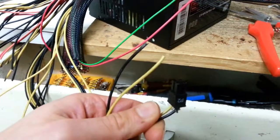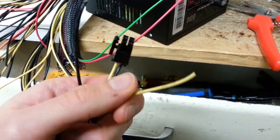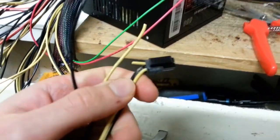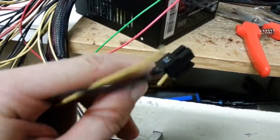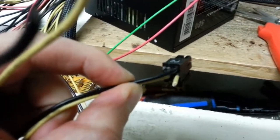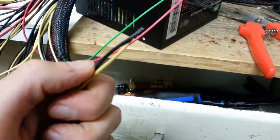As for the other two wires, one of these will serve as the negative terminal wire, and this yellow wire here will serve as the positive output wire. You can get these from the power rail P2 connector, and what you want to do is make two cuts diagonally on the connector there, and then you'll have your two wires ready to go.